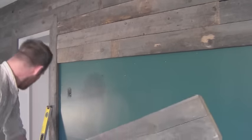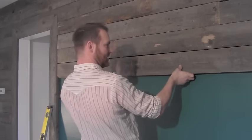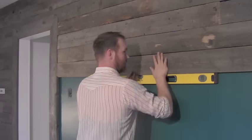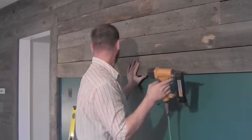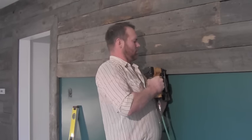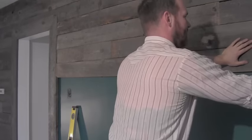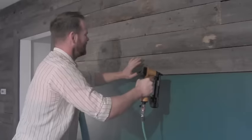I'm going to show you how I stick it on. It's all simple, but it never hurts. One of my biggest pet peeves is that no one ever shows you the little details — they show you the finished product. This one's bending down a little bit, so I know I'm tight. Use some strength. About every foot I stick three nails, roughly foot to foot and a half apart.